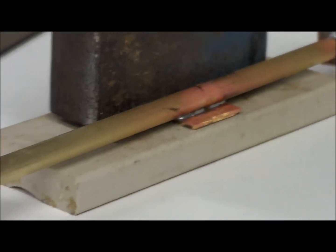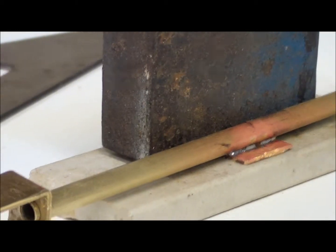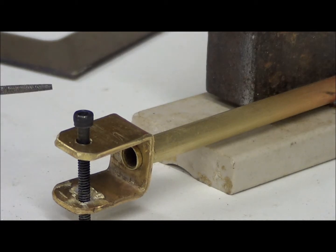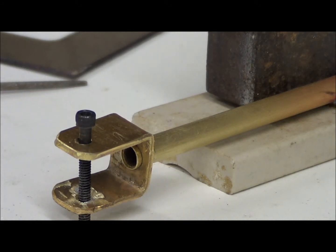Okay, we have to set up now. I'm using a block to hold some pressure on that mounting plate. And you can see right in here, I've recessed the main axle tube through this piece, the U piece here. And that's going to give me a stronger soldering joint rather than just butting that tube up against the flat side of that plate. I've been having problems with Ice Racer number 1 cracking and breaking off, so Ice Racer number 2 was done the same way. We're doing 3 the same way.